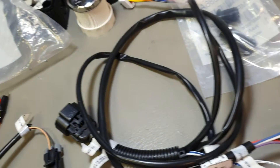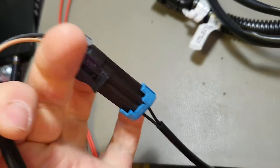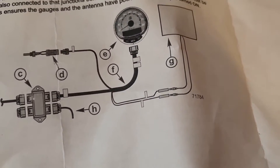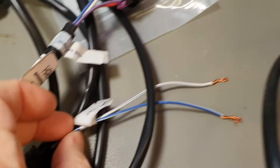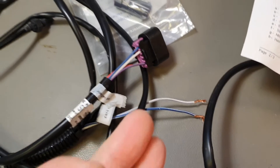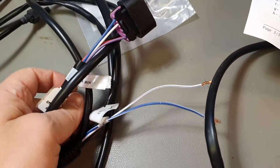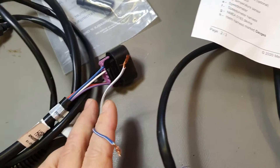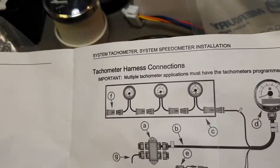It has a place for the temperature sensor — it says 'air temperature' right here. It also has two cables for an NMEA 0183 device, which is how you can provide speed from a GPS unit to the gauge. I have a couple of videos about this — I'll put the links in the description.